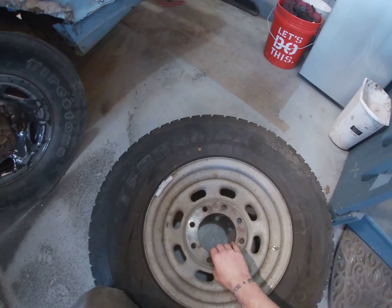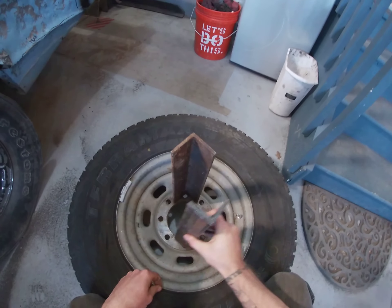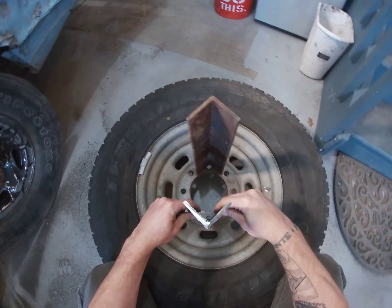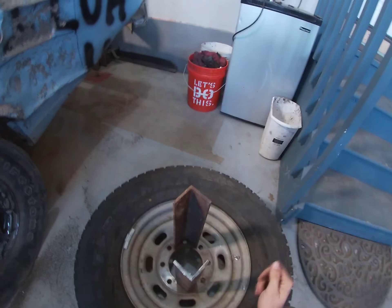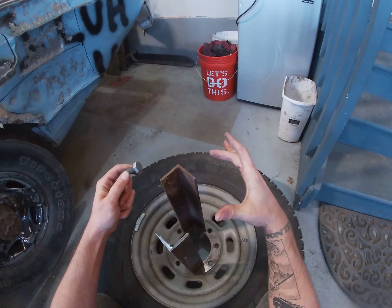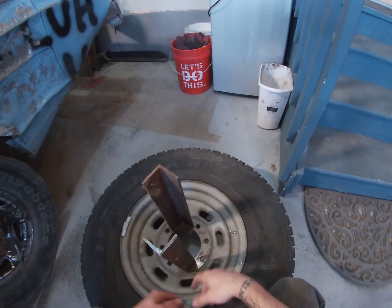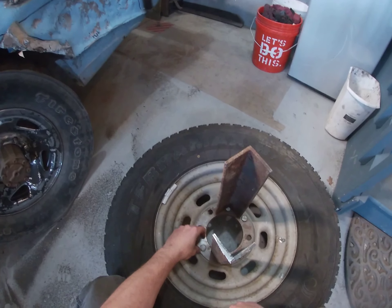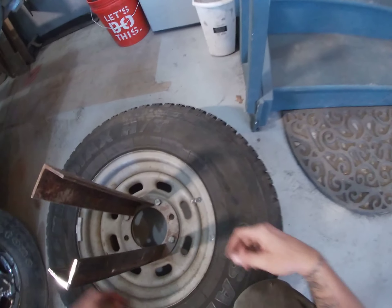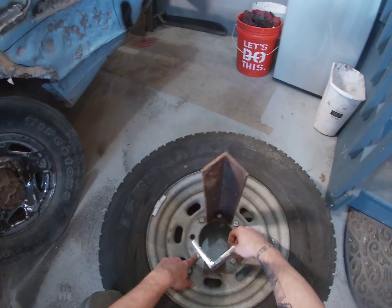What I'm going to build: I'm going to take this wheel center and take these pieces of angle iron and weld them like this. First I'm going to make sure they're the same height. It's going to go a little something like this, and then this will get a plate up here that I have to cut. That plate will be welded underneath the bed of the truck. This tire will be flipped so it'll snug up under there a little bit more, and then these bolts will get welded to this side as well.